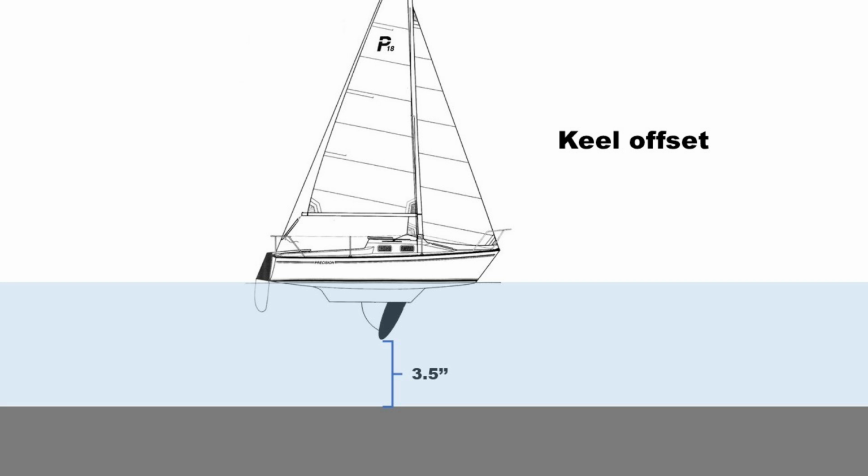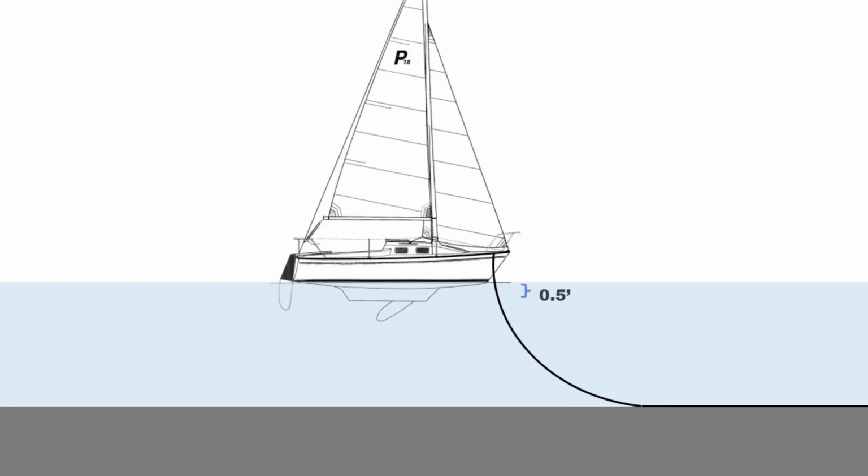If a keel offset is configured, the reading will then be the depth of water under the keel. So you'll need to add the total draft of your boat back to the depth sounder reading to get the true water depth. In my case, I didn't set the keel offset because my draft varies depending on whether the centerboard is up or down. So I just wanted my depth sounder to display a true depth measurement below the spot in the hull where it's mounted. With my depth readings, I know I need to add 6 inches to get true water depth. So you just need to be aware of where you are shooting your depth soundings from and how close they are to actual water depth measurements.